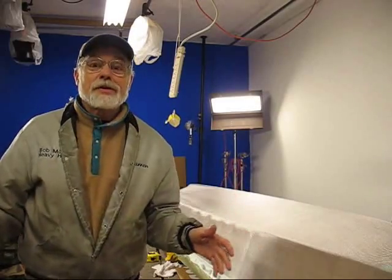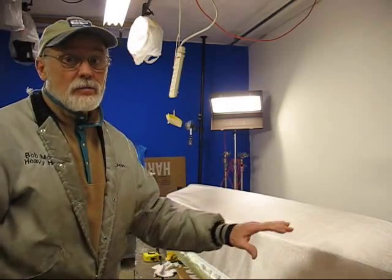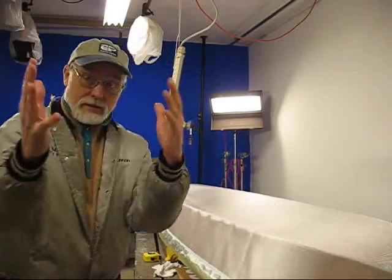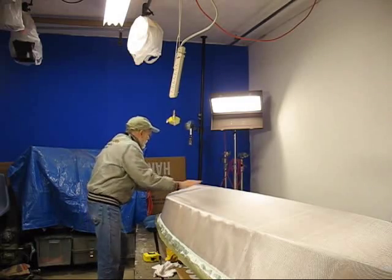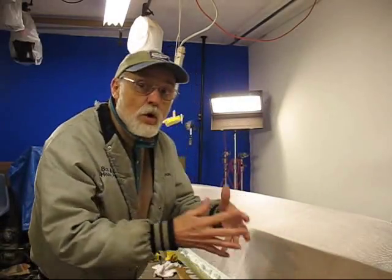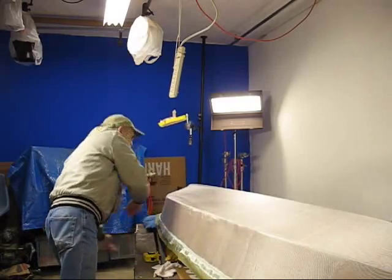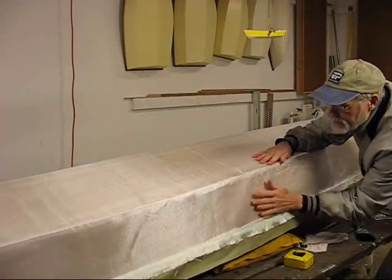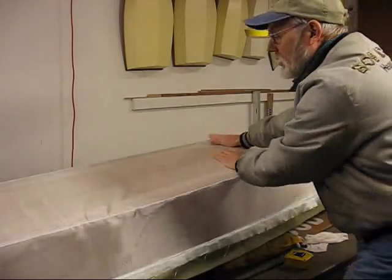It's been a few frustrating days getting this cloth to settle in. This is the first one I've done where I've taken the cloth all the way up to the gunnels, plus the hull is very shaped. So what I've done now is I've taken the gloves off and I've been moving excess cloth away towards the stern. I've already finished the other side. I've got my little problem fix to keep my fingernails out of it — you can see how I'm chasing this stuff along, being more aggressive in moving the material.